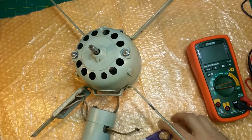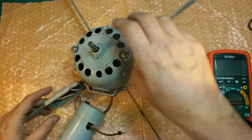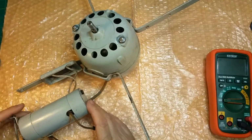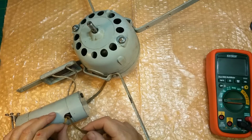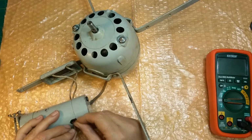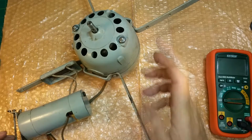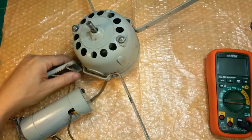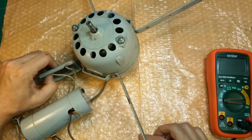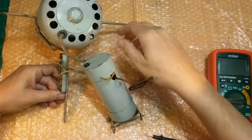Okay, the one that I recently uploaded that had the bad stator had a blown resistor. It was totally open, and the capacitor was actually tested good in that one. Amazingly. Oh, there's the other wire. Oh, wow. Yeah, the insulation's come off it. Hopefully the fire blew out of here and not out of the motor, but I believe he said it blew out of the motor. First thing we're going to check is this resistor and see if we have any continuity on it.